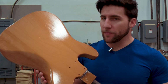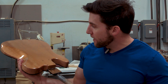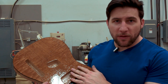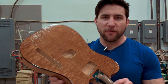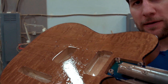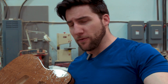You can see it's kind of transparent but also gold, which is cool — a nice metallic gold. So depending on what angle you look at it from, it's either an opaque gold look or you can just see the grain. Anyway, this guy's got that burl veneer on the top. Ash burl has some very deep pores as you can tell, and you can still see some of them in here. The coat looks nice, but you can still see the texture of the grain there, which isn't ideal and means we're going to need to do more coats.